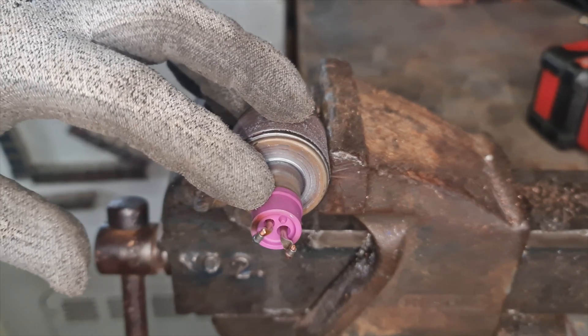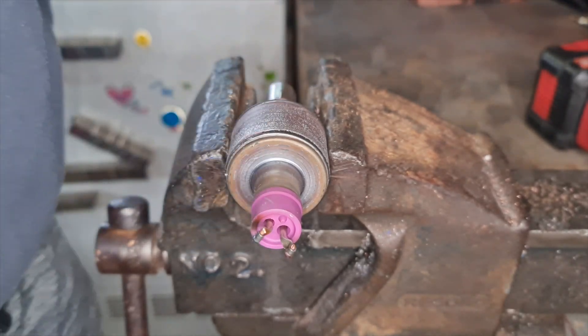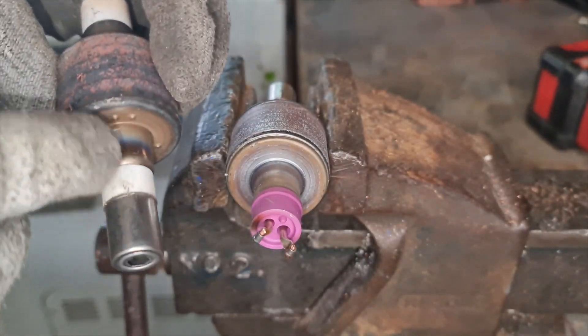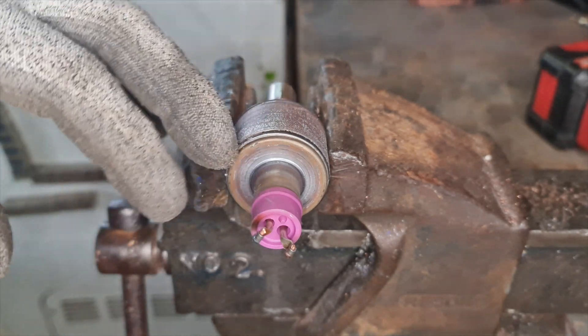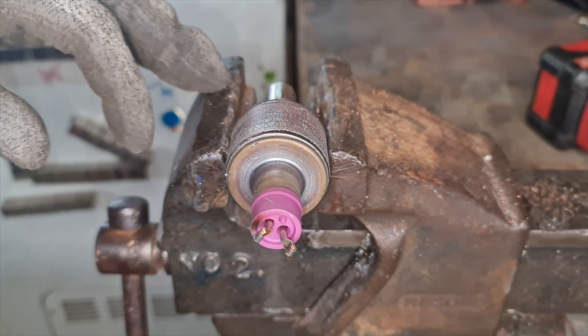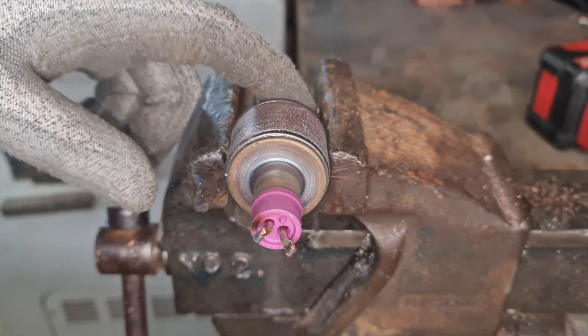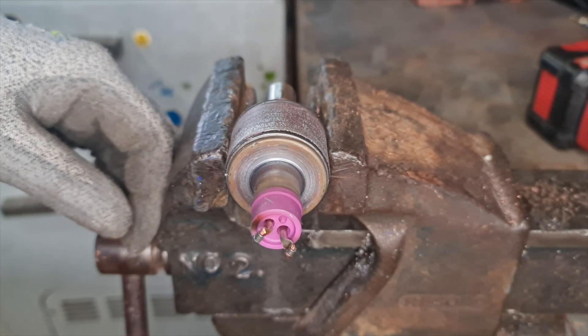Now as you can see here, just a bit of a disclaimer — you have pink beryllium and then on this one here you have white beryllium. Just be careful with these because if you shatter them and breathe in the dust you can develop berylliosis, which is a form of lung damage because of the beryllium present here, and in the long run it can lead to lung cancer.